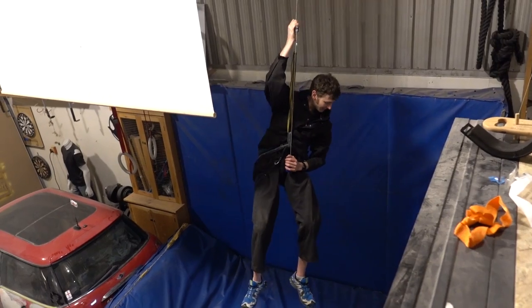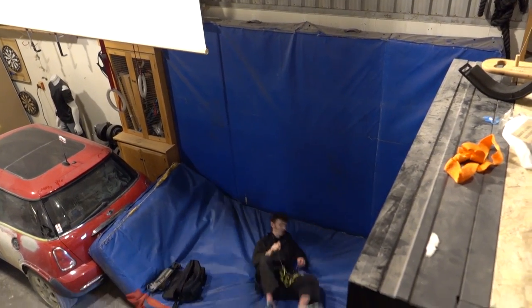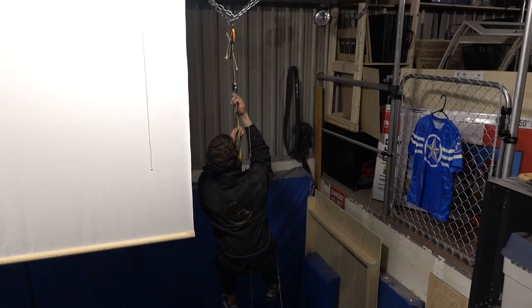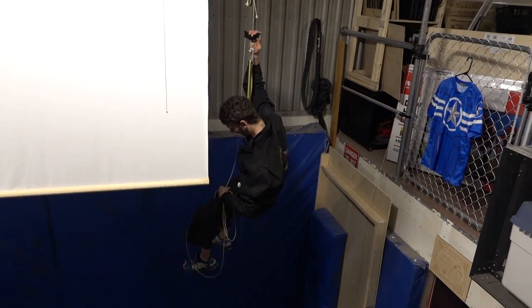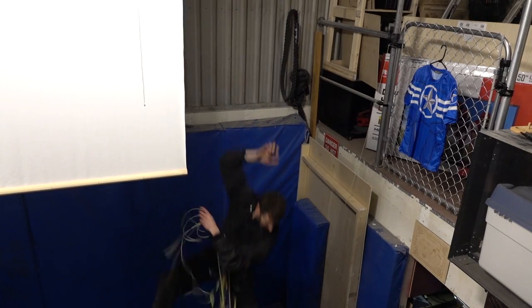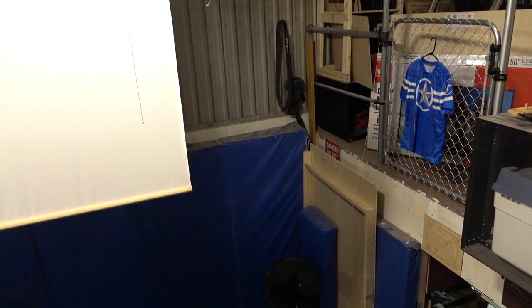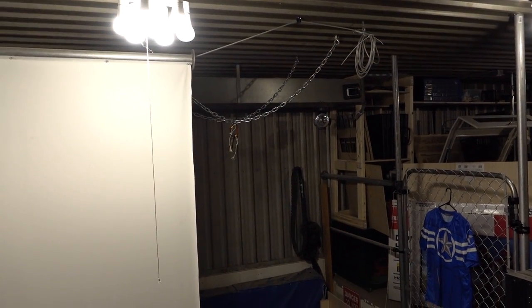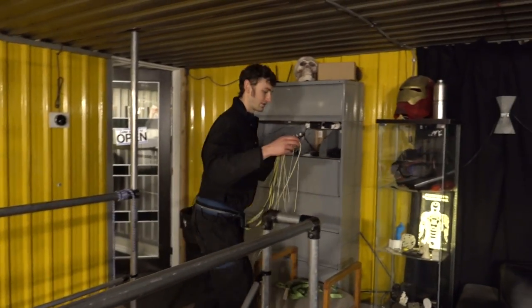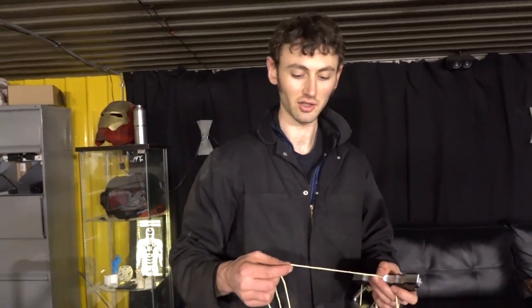Because of that, we actually noticed there's another problem. So you're scared to press the button? Press the button and that happens. The rope broke in the same place again? Yeah. Why? The issue is that it's static rope — there's no stretch. So if you have any kind of momentum, that's not absorbed in the stretch of the rope. It's just immediate impact, and that causes a break.